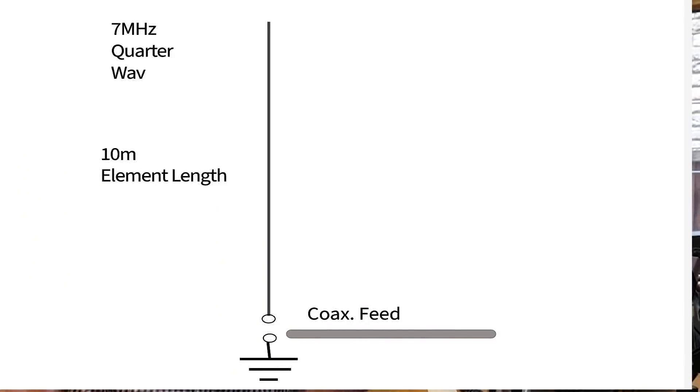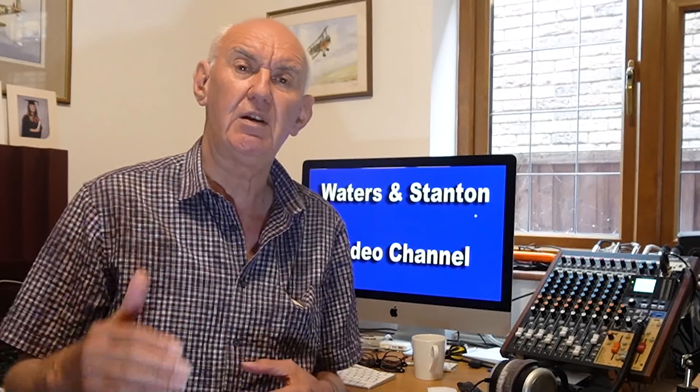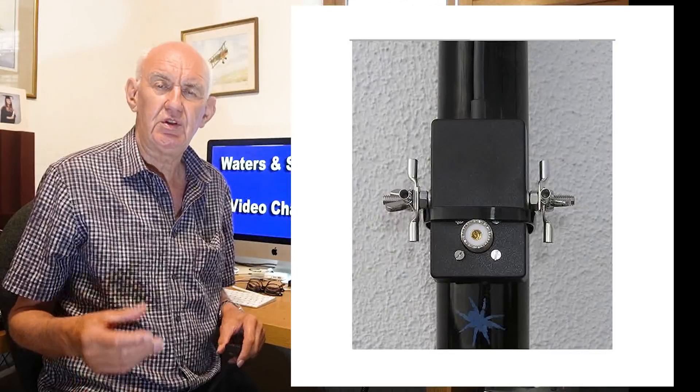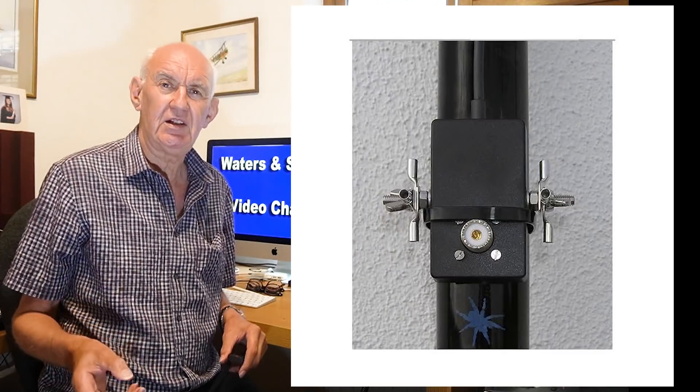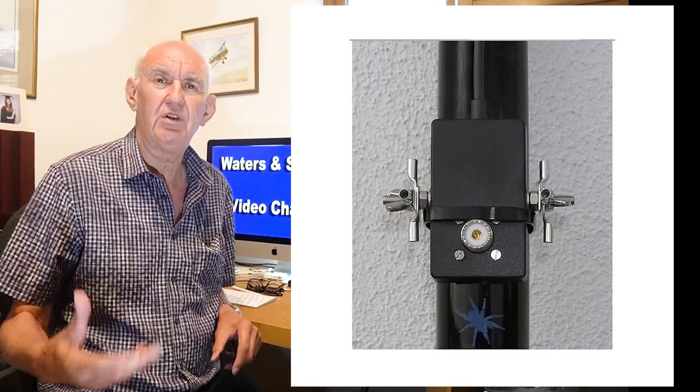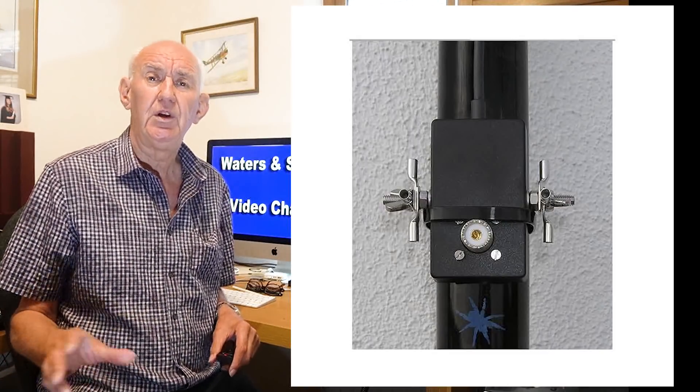You'll see on screen the basic idea of a quarter wave vertical — again, the dimensions are ballpark figures. You can cut that antenna at any point to create two bands, so it's perfectly feasible to have an antenna covering 20 meters and 40 meters — all you've got to do is either short or open circuit that break point. I should add that if you want to use the spider pole as a quarter wave vertical, Spider Beams do a little SO239 adapter box which fits at the base of the spider pole. You can plug a PL259 into this junction box, connect your vertical element, and there's also provision for connecting radials.